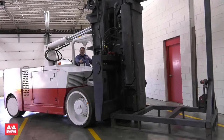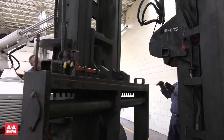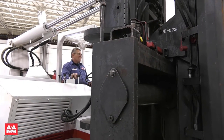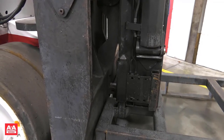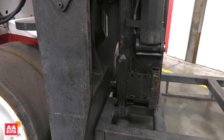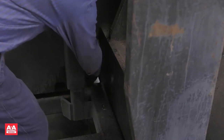Let's review the boom installation. The interlock must be slid all the way out to install the boom. There is a connection point on the back of the boom and on the top of the carriage — this is the primary alignment area. The next step is to align the lugs on the bottom of the carriage and boom. The operator should visually line up the boom between the mast on the top as they are approaching. Once the operator comes in far enough, signal the operator to come up and you will see the connection point being engaged. Once the boom starts lifting, tilt back, hold it there, and install the boom lower pin before lifting the boom from the boom stand.